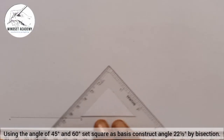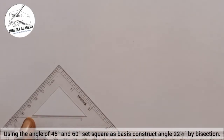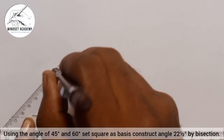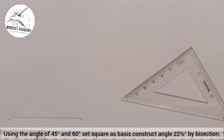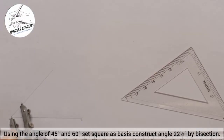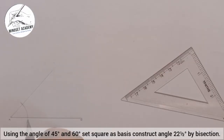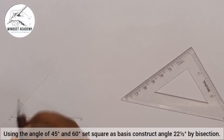I'm going to move the set square until I get to point A, and I'm going to draw a line this way. I'll use a faint line because I'm not looking for 45 — I'm looking for 22 and a half. If I bisect 45 degrees it will give us 22 and a half. Placing my compass at this point, I'll draw arcs on both sides. Where the arc intersects AB I'll call A prime, and where it intersects the incline I'll call B prime.